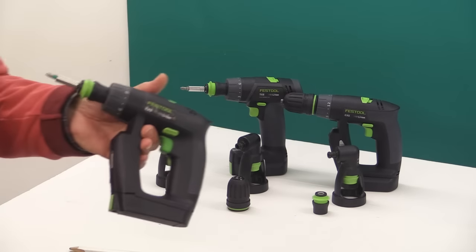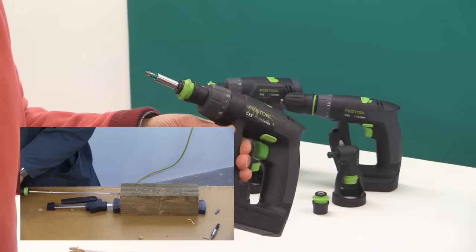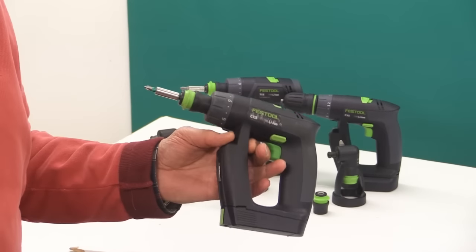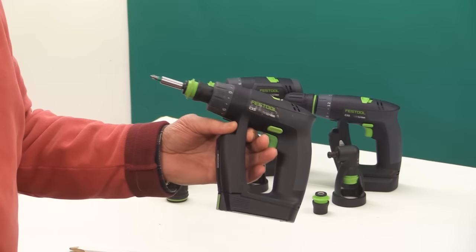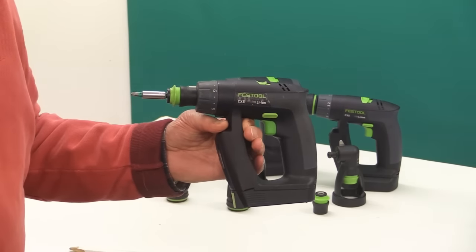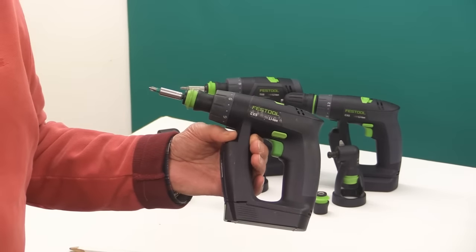This is my original CXS. I've had it for a number of years — at least three — and I made a video about this quite a while ago. This really and truly is my go-to drill driver. I'm quite happy to use it for screws up to 5mm in diameter and about 40mm long, and 4mm diameter screws up to 50mm long, so it can handle some quite reasonable-sized screws. I would use a 20mm Forstner bit with this, even though Festool say you shouldn't. I can certainly use my full range of Brad Point bits up to the maximum size I've got, which is 12mm — all drilling into wood, of course.